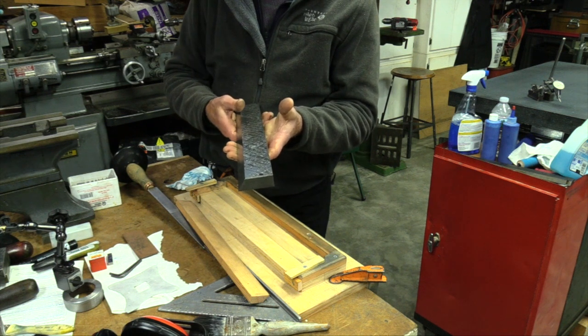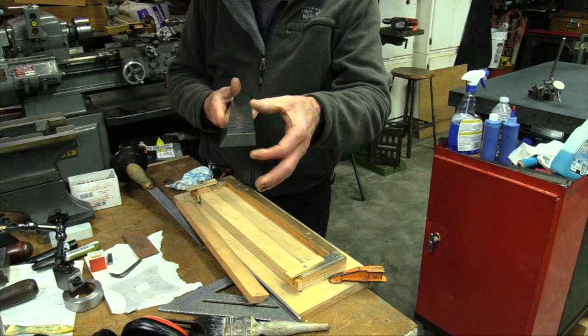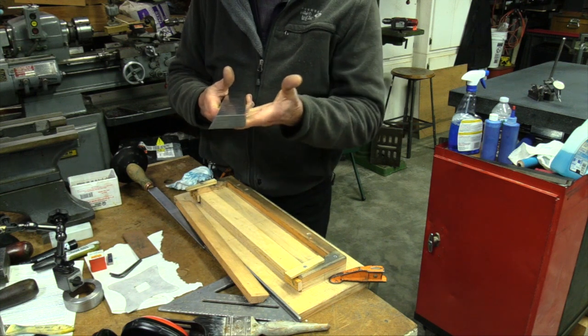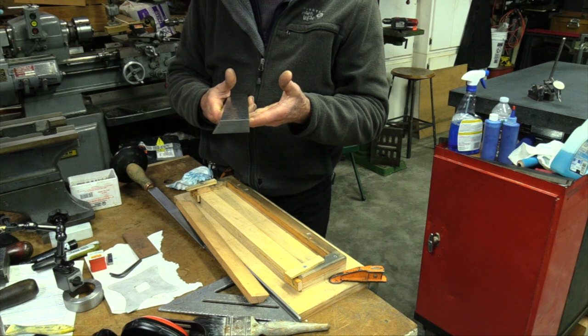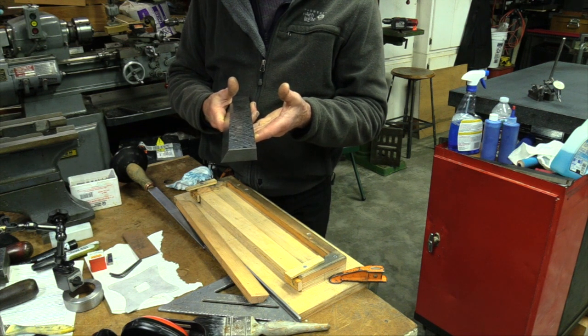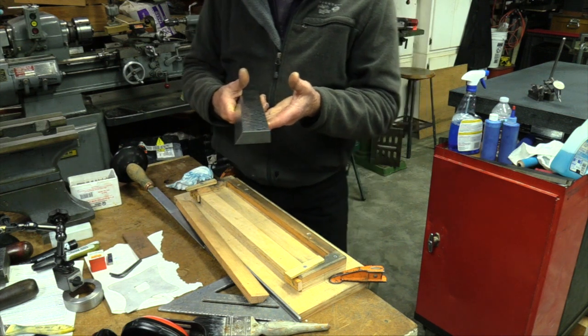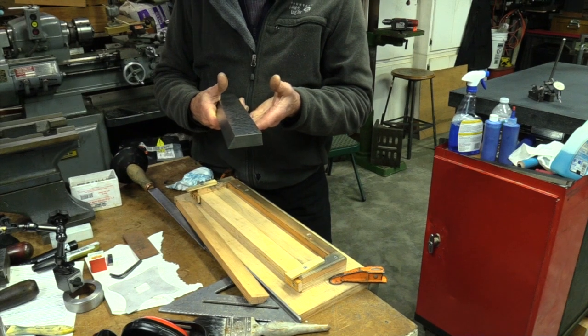It was more for practice for me to get another surface to scrape and flat. But what I'm trying to do is make it parallel to the A side. Sure. Now, are you using a hand scraper or power? This is all hand scraping. Yeah. You like hand scraping? I do. And plus, I don't know if I can justify the cost of a biax scraper.